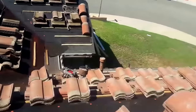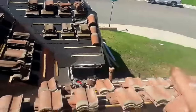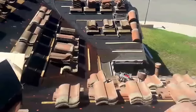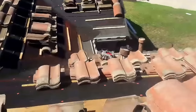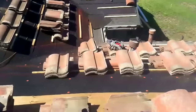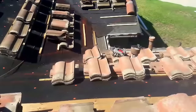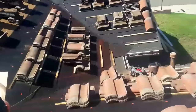I start loading from the third row and up, and I usually space them about six tiles per every 22 inches across until I get to the ridge. When I get to the ridge, I usually count the last three rows and then add the other tile on top — I always finish with nine on top, starting with six. The problem with a tile reset is you're going to have to put the tiles and cuts where they belong, otherwise you'll have to make new cuts, and that takes time. So it's recommended that you mark them before you take them apart. But this time, I sent someone to remove the tiles and they didn't mark them for me — they didn't know.